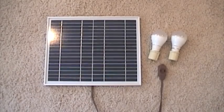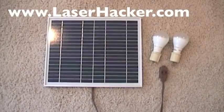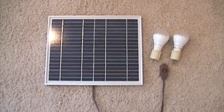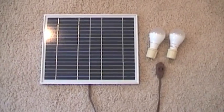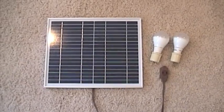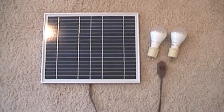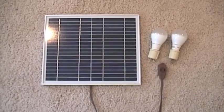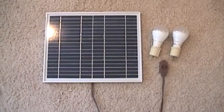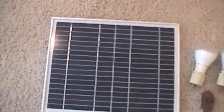This is the Solon 1, inspired by Laser Hacker — you can find information on it at laserhacker.com forum. This is a 10-watt solar panel and I've got an 18-volt battery pack in it, so it doesn't need a charge controller. It can't overcharge because this solar panel puts out about 19 volts, so when the battery is fully charged it basically just stops charging.